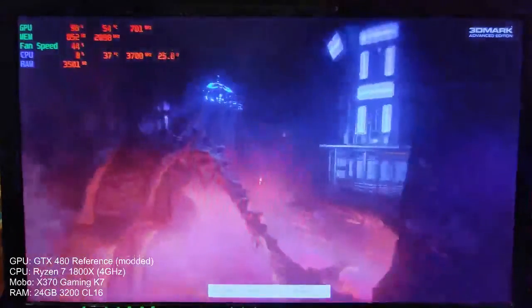So please run 2100 now. I put a lot of time into those mods. I mean, GT2 is the memory test, so if this passes, the other one might crash. Which is why I'm not pushing core right now, because we don't want the thing to crash because of core and then assume it's memory.